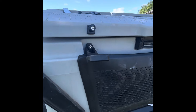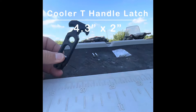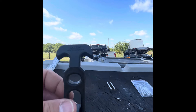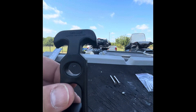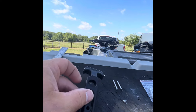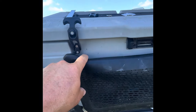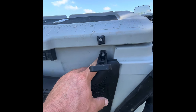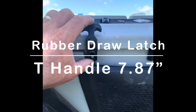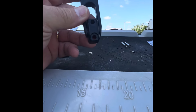At the end of this video, I've got pictures that I'll show you off of two different Amazon orders that I made. These are the smaller latches and these are four and a half inches. When they measure four and a half inches, they're measuring from the bottom to the very top of the handle. The space between the bottom of the latch and the actual hole where that pin goes through is only about two inches. Now, if you choose the smaller set, then they're going to be inset in this area right here. The larger set is about seven and a half inches — that's from the top of the handle all the way to where it screws in down here at the bottom.